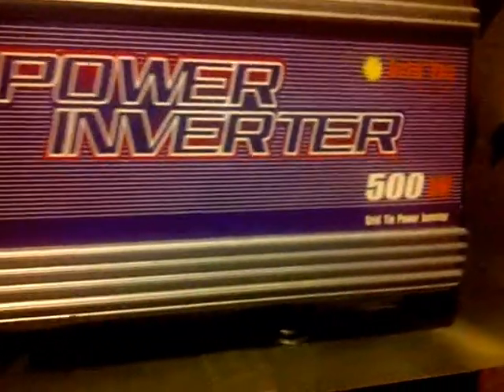So here what we have is the rectifier — there's the three-phase coming in off the turbine, and there's the DC positive and the DC negative. They simply go over into my box here, and the positive will run to a shunt in the back of that box, and that shunt works my amp meter.